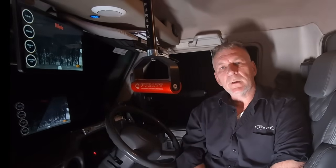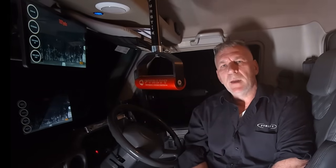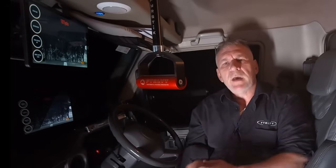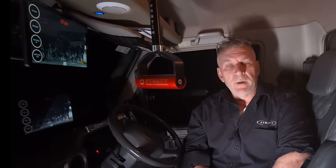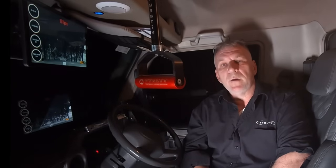Let's talk about DSM — Dynamic Stream Management. This is another unique feature with the new FTV system and we think it's the first of its type in the world. One of the issues that's plagued most thermal systems trying to stream is frame drop and the lag that results from it. Firelight has developed a clever piece of software that simply detects any frame drop and removes those lost frames in real time, maintaining a stream of just a few milliseconds. Traditionally when you Wi-Fi stream you carry a buffer of five to ten seconds, which is not appropriate in a system such as this. It's very important to deliver the image in real time, and the only way you can do that reliably is to manage the stream dynamically — when frame drop is detected, you rapidly remove those frames and bring the camera and tablet into sync to the current frame without accumulating lag.